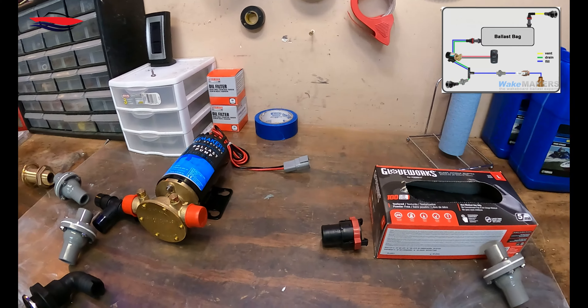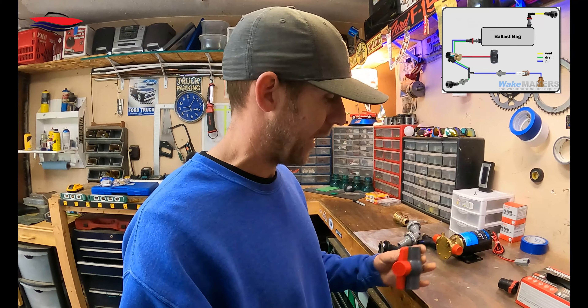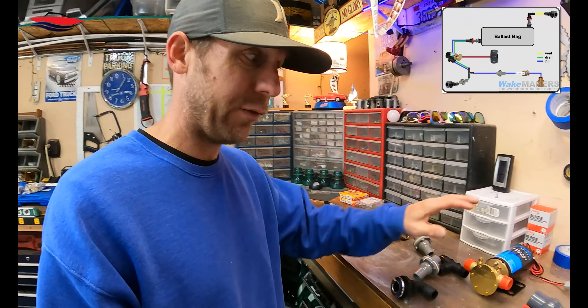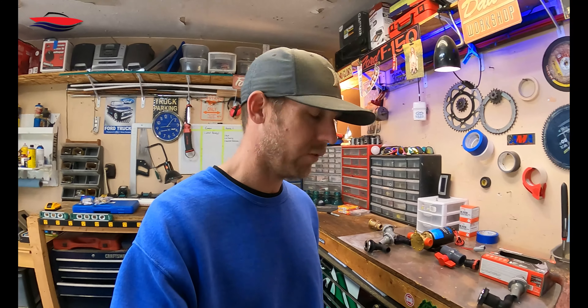That's how I'm going to do every bag. The center locker bag will not have a valve on it. If I decide to piggyback into that bag later, I could put a T on it — even run a bow bag under the bow seats the same way, still using just two pumps with a valve to shut bags on and off. The plan is to get another pump eventually, but money, money, money. So that's the overview. The first step is getting all the vent lines done. The next video will cover running the vent lines, drilling the holes, getting the vents through the hull. That's number one — stay tuned, thanks, bye.